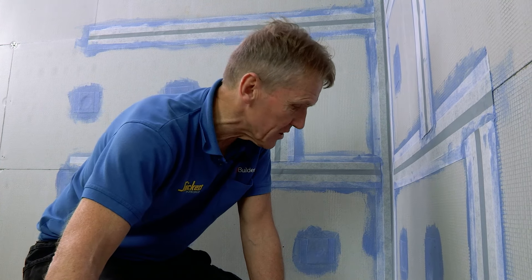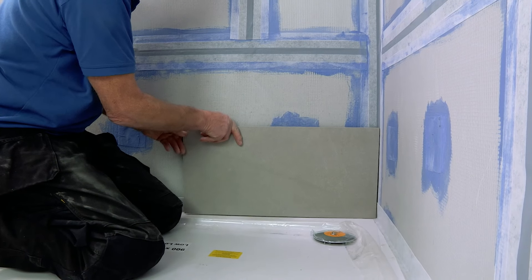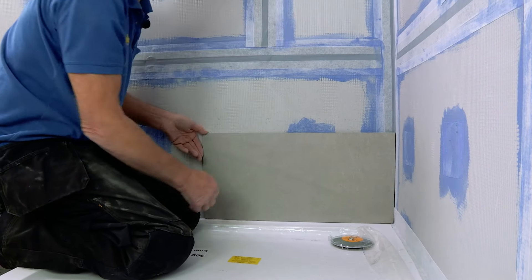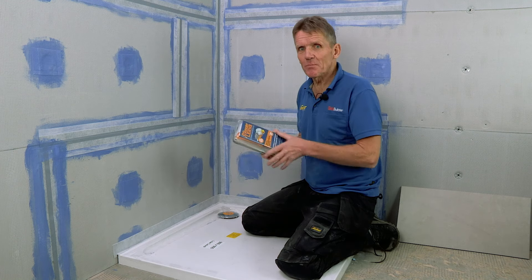With the corner, you can actually put this long piece of tape on the edge before you even put the shower tray or bath into position, then simply pull it on. If a long length is too much for you, you can cut it into sections as long as you overlap by at least 20 millimetres. I'll dry-fit the tile to show you — you can see it covers the tape at the bottom. We still apply the silicone seal along the front of the tile to give it that first line of defence, but if anything goes wrong with that silicone seal, the tape is doing the job behind it — so really it's a double seal.